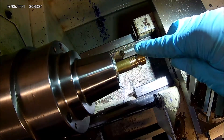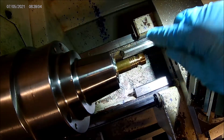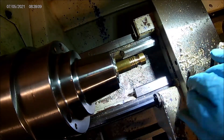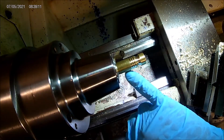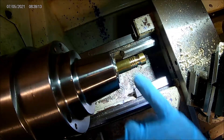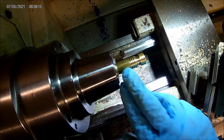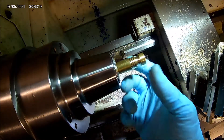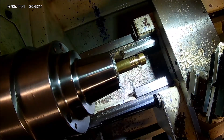We've got our profile cut here. I'm going to take this over to the mini lathe and just part it off. I'm going to hit it with some sandpaper to clean up the outside diameter, part it off, then flip it around and machine the nose of this. It's going to look like a sort of old-fashioned bomb. We'll be right back.